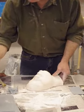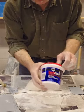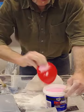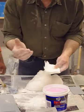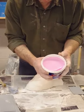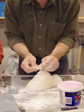We'll set that aside because we're going to want to use it again. This is the filling compound that I think works the best. The reason for that is that it seems like a pretty high quality product. And it's pink — the reason that's good is quite simple: when you put it on, you can see where you've put it. It won't stay pink, so don't worry. When it dries, it turns white.